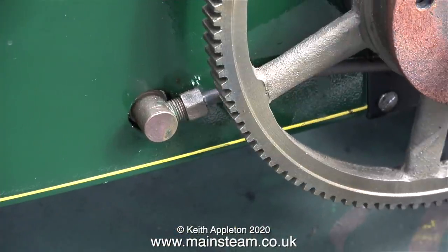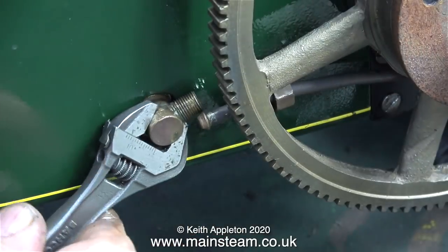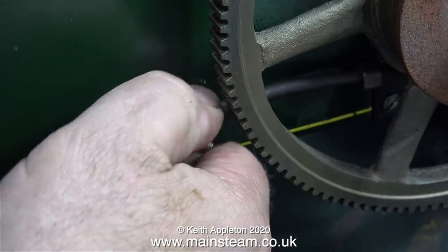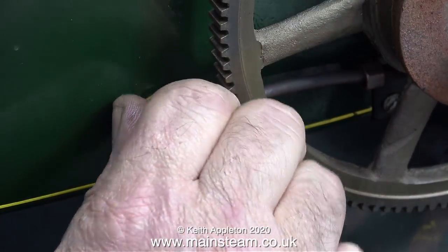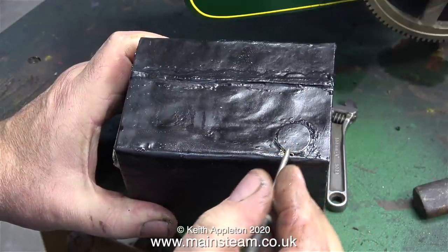Now to take out the other side — this one is the water feed for the crankshaft driven water pump; much more about that in a future episode. The fitting at this side is much tighter. As the water tank is a soft soldered copper tank with soft soldered bushes for the fittings, I'm a little bit concerned. The worst case scenario is that the soft soldered bush just rotates and won't come out. But by thinking positive and using plenty of WD-40, the part came out okay. As I was unscrewing this fitting it got easier as it went along as the WD-40 penetrated, but I did lose the will to live on several occasions. And at last, here's the tank out of the bunker and on the bench.